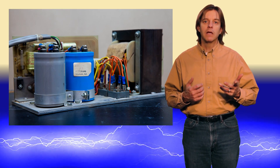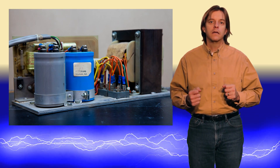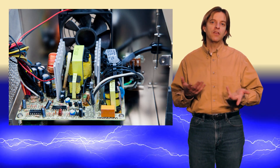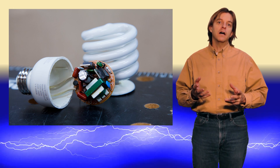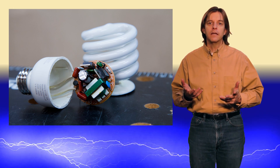There are two types of ballasts: magnetic and electronic. The difference is kind of like the difference between a linear power supply, like you might find in a heavy component stereo amplifier, and a switching power supply, like you find in most consumer electronics these days. Older units, like mine, have magnetic ballasts. More recently, electronic ballasts have started to take over due to lower manufacturing costs and increased reliability. The rise of CFLs in the last decade or so is due in part to the development of these electronic ballasts.